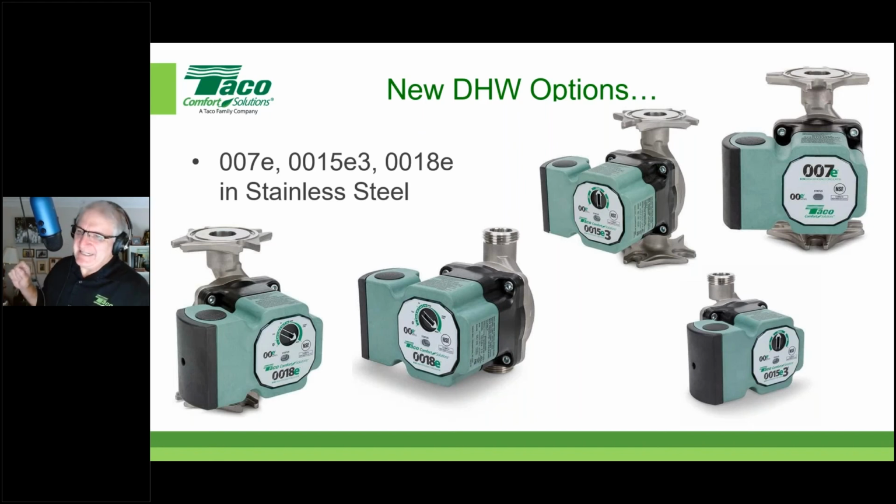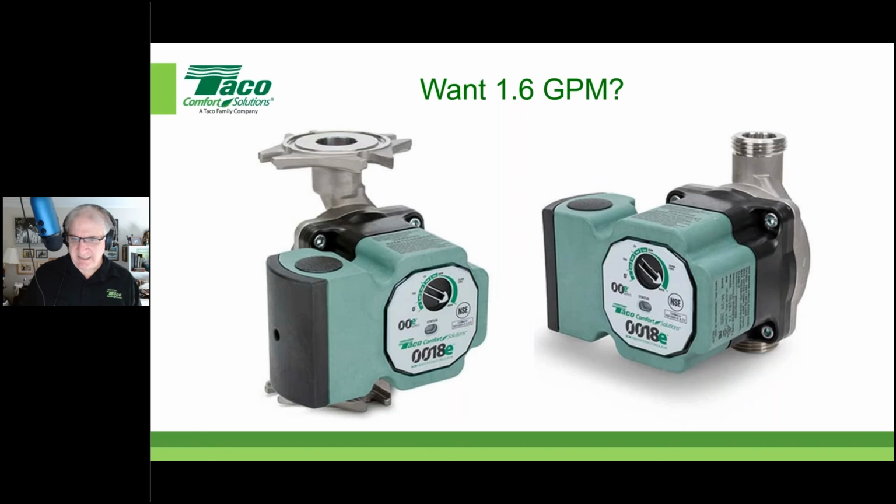The 0018E is the one I want to focus on, because the 0018E, as its hydronic heating brother, has Bluetooth connectivity to an app, right? And you can connect to this app, and it opens up a world of diagnostics and programming. The part that's going to be most useful to you for the 0018E is if you really want 1.6 gallons per minute, if that's how you want to set this up, you can do this again without a circuit setter.